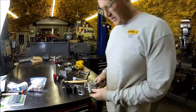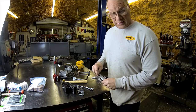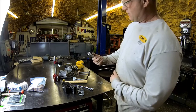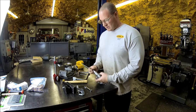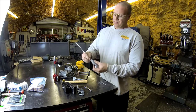Well, nothing special. I didn't show it drilling it, but it's a tapered pin, so I drilled it like a 19 and then a 20 on the other side and ran the pin in. And as you can see, she's good and snug. So let's hope we did this right, and we'll have us a repaired pistol grip air gun.